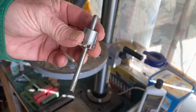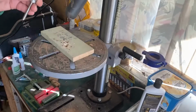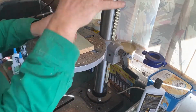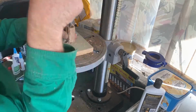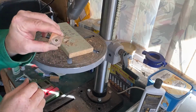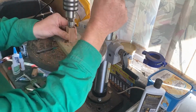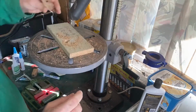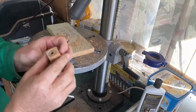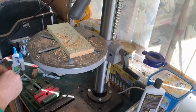So I've changed from my 7mm drill bit. I'm going to put this tube reamer in it, and it brings the blank down to the size of the tubes. So you can just see the brass. What that reamer does is it makes sure that it's cut perpendicular to the tube. So if you haven't drilled perfectly straight, it's good to go.